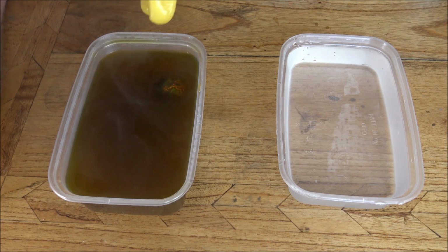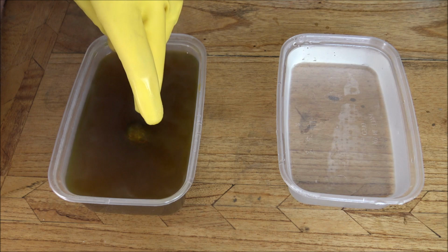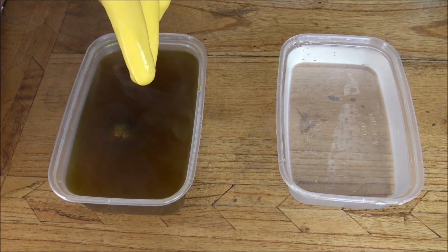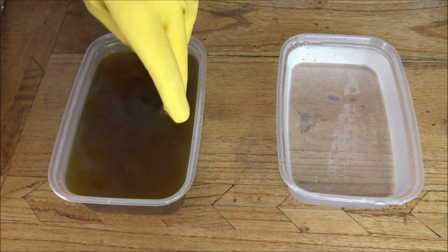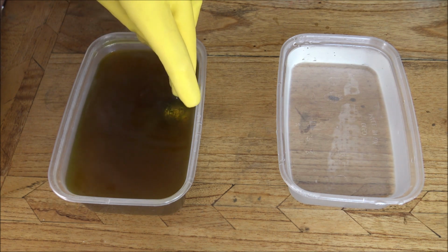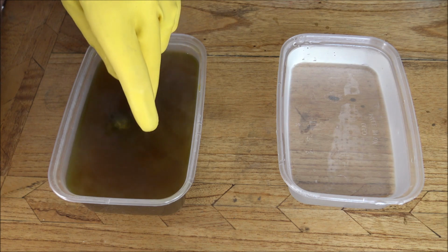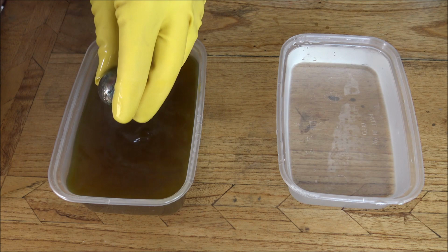And just as a tip and a hint, if you are going to patina things and leave them in for a very long time, for a really thick patina, it will take a lot of elbow grease to get rid of that patina, or to get rid of it on the highlighted areas. So be careful of that, because I've had a few pieces ruined where I just can't get the patina off, which is amazing really how thick it is.